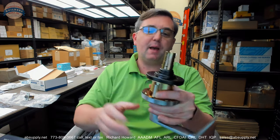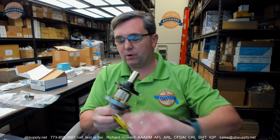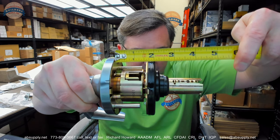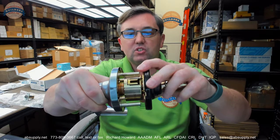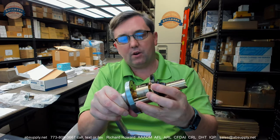Since we are just here talking about door thickness, when I slap that on, I can put my tape measure on the chassis and see that it is going to handle an inch and three quarter thick door — that is just going to stand off a little bit. It is going to be fine; that is all there is to it. We are in really good shape on all of that.